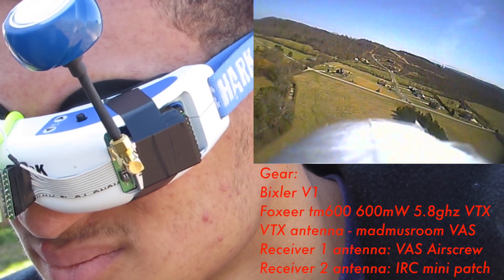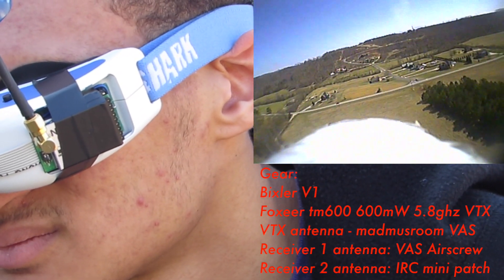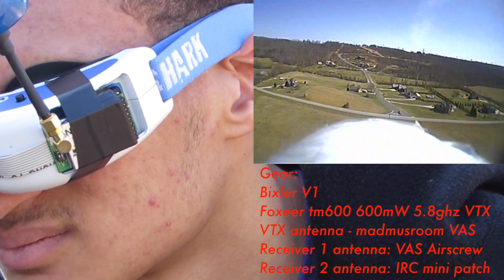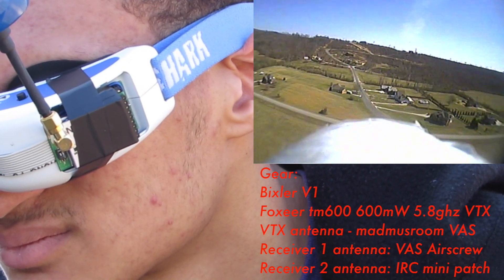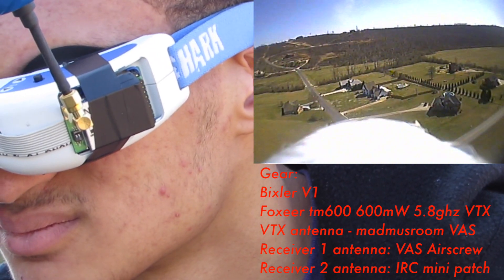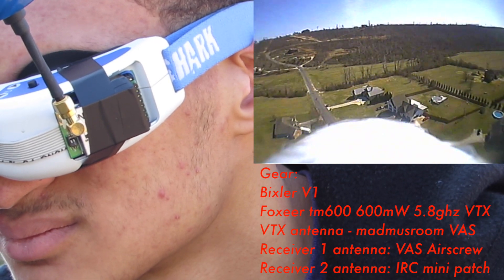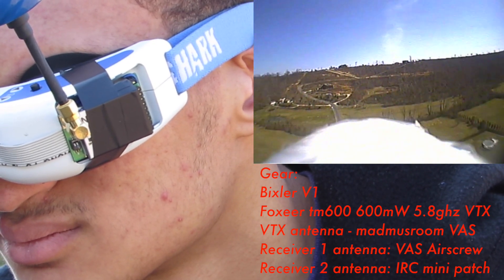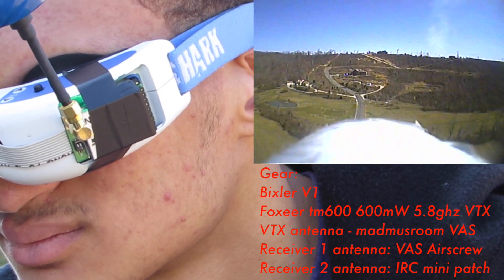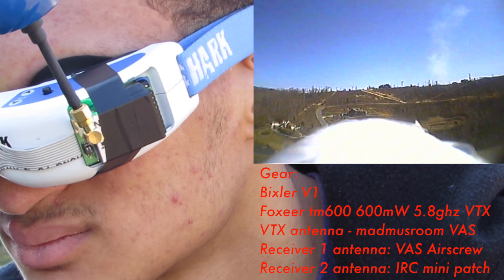Anyways, I took the first flight. The first direction I took was straight behind me, and you can see that the blue light was on most of the time. And then when I turned around and flew in front of me, the green light turned on, because I had my patch antenna on the second Nexwave receiver facing in front of me. Now, if you look at the video, you'll see that there's some fast switching between the two, and that can be worked out.